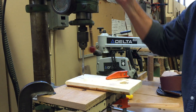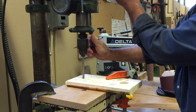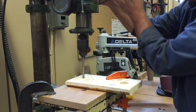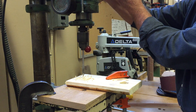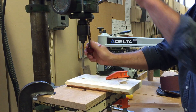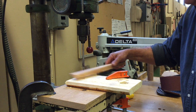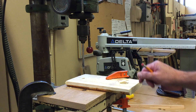Now I'm ready to drill. Start it up and feed down real slow. Sometimes there may be a little tear-out. Once you get down in there, if you see different colored wood chips coming out, you'll know you've drilled all the way through. It's not a race. Don't use your hand to clear chips — get a piece of wood scrap, a little hand broom, and clean that out.